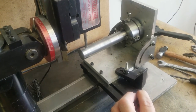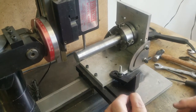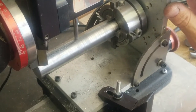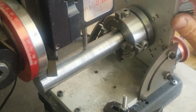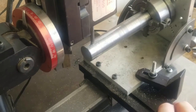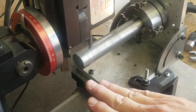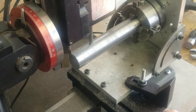I'm going to lower this just a couple of thousandths initially and we're going to set it to go back and see how we do. At first I'm not doing much of anything, but because the shaft isn't completely smooth I'm just wanting to knock off anything high and make sure it's gone before I get serious with this cutting. Now we're going along with about two thousandths per pass cut, starting to get serious with cutting this. This is going to take some time, but because the cantilever is so heavy on this machine with this setup, I'm going to run it real slow and accomplish this on a machine that's normally way too small for doing this.